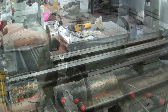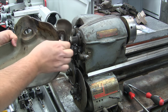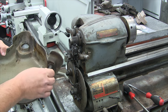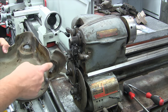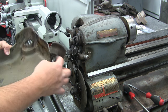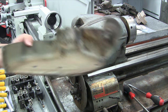This side gear cover is damaged — this stud is kind of broken. Are you thinking you'll silver solder that? I might make a new piece for here, cut the relief in it, bore this out and press it in, then put a set screw in there. I'm going to try to repair it first to keep it original rather than buying a new piece.